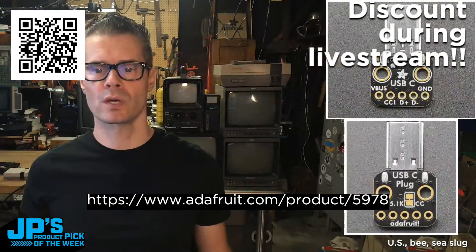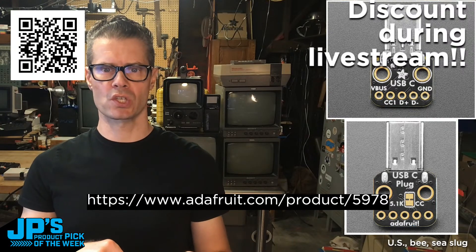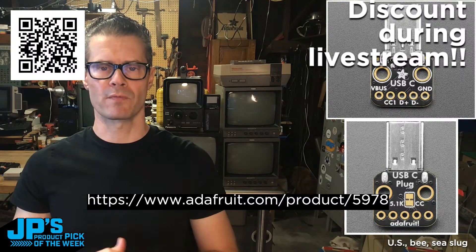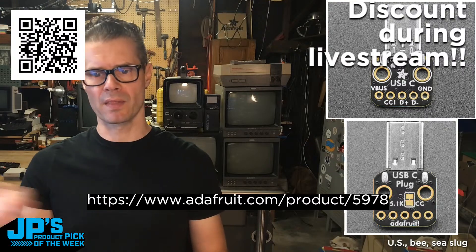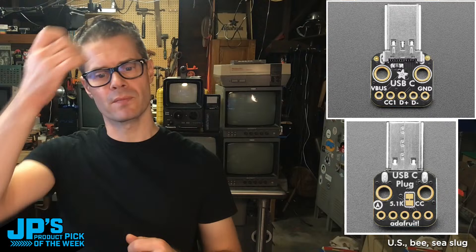Sorry, I had to redo the whole show because YouTube didn't want to launch at first. Here are some nice close-ups. It has the 5.1K resistor that is used to show this to a USB-C receiving-side computer that this is the plug end of a device. You can leave it alone for the type of use I did — just connecting data plus, minus, ground, and power. Or you can connect a different resistance level by cutting the jumper and connecting up your own CC1 cable to another resistance value, to send different USB port or plug-side messages.